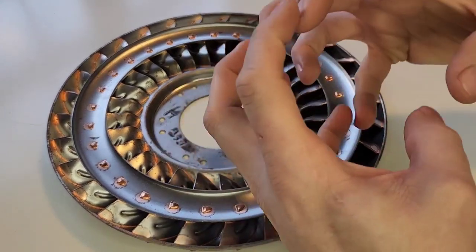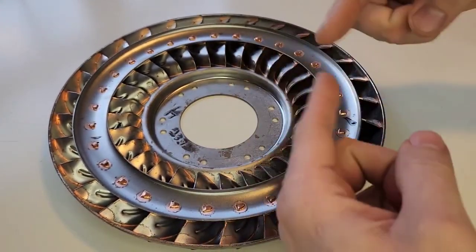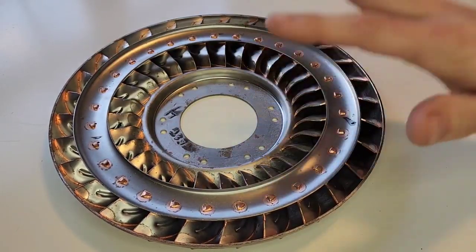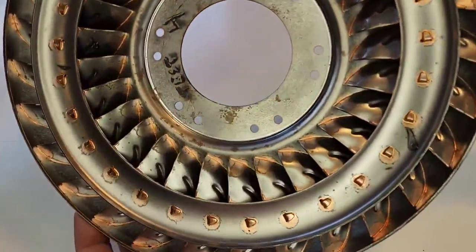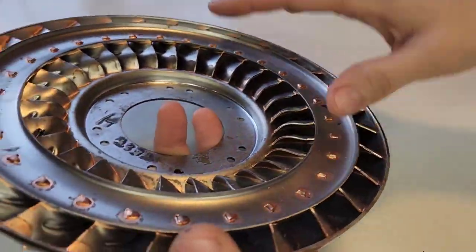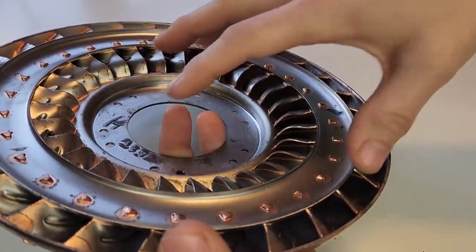So it's like putting two fans next to each other - one spins and it tries to make the other one spin because it makes a lower resistance in the fluid as it's trying to move. That is how a torque converter works. Why would you want something this complicated in there? They're designed like this to be as efficient as possible for transmitting that force from one side to the other.